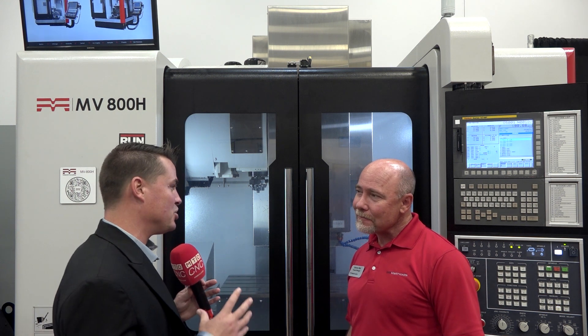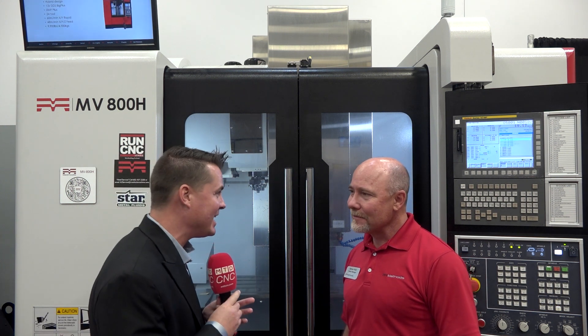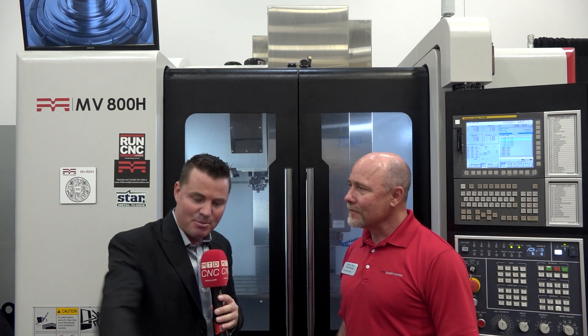One of my favorite things I've seen over the last few years is a three-axis machine — which was standard for a long time — but we're starting to really progress into how much can I get done. I love the accuracy of the quick change systems on the market right now. The ability to have a table right in front of us with a couple of extra vises that I can just switch — that's almost like having full automation, running those parts back and forth because of those quick change systems, which can also be on trunnions. It's almost like adding a pallet changer. You're reloading parts in a couple seconds versus a couple of minutes. A lot of vendors out there with great product that can reduce that time waiting to load parts. That's a home run.